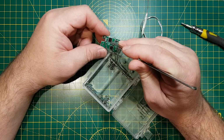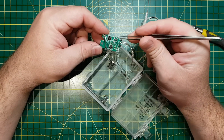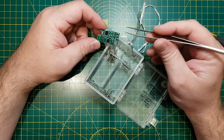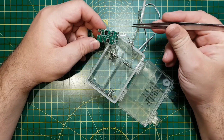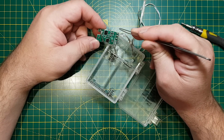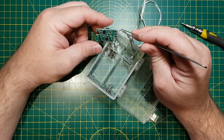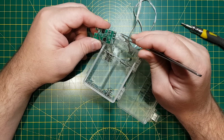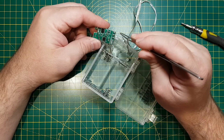So this is likely to be a Darlington chip, which is an IC with multiple transistors inside it. And the way this works is when output 1 goes live, so it gives a positive voltage, output 2 has to be connected to ground, and vice versa. And that's how, as the power comes on and you give it a duty cycle, it'll go bright, and you do the same with the second one, and it just flicks back and forward rapidly.